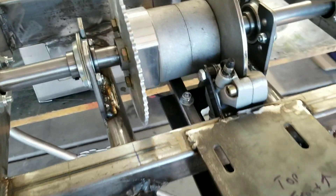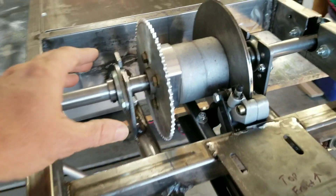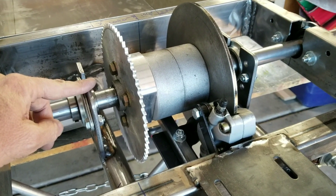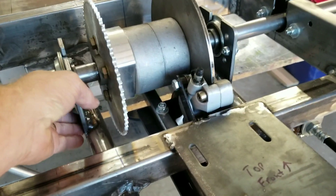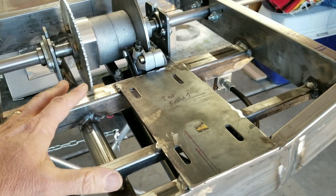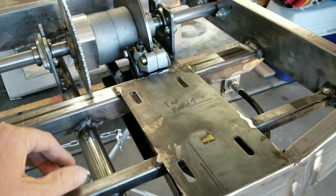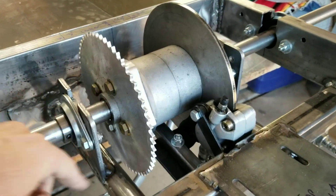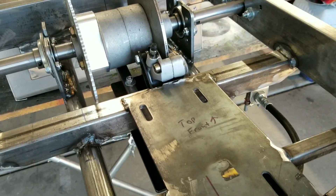One other thing to mention: as I was welding all the different brackets and structures, I found the bearings kept getting tight as I spun the sprocket. The brackets were no longer aligned, so I had to cut them off and re-weld them. What I'd recommend is to mock up where the inner bearings are going to go, but don't mount them until your entire rear structure is done. When metal is welded, it moves around a little bit — things shift just enough to put them slightly out of alignment. Wait until everything else is in place before welding those brackets.